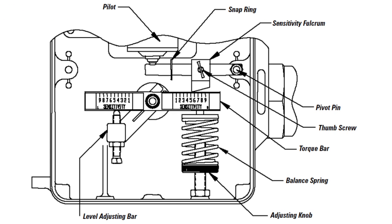Now let's get back to installing your level controller. This illustration shows a direct acting right hand mount controller. The Series 1001 level controllers are also available in left mounted and back mounted options. The 1001 Series controllers are based on the forced balance principle. A spring balances the weight of a displacement type sensing element. As liquid rises around the displacer, the amount of force available to the pilot is proportional to the weight of the liquid displaced.